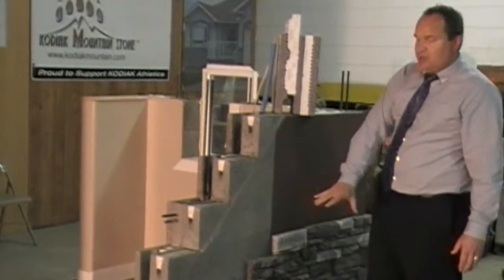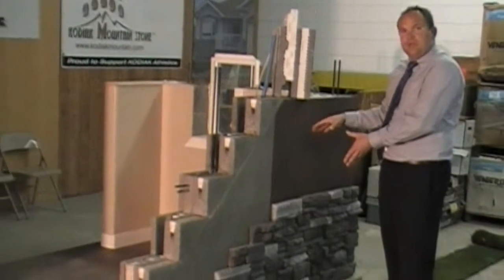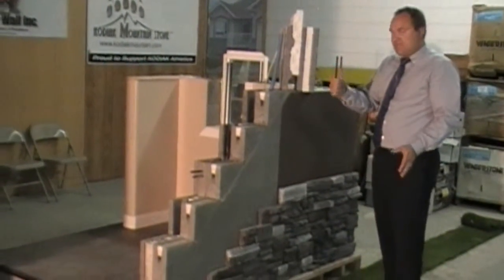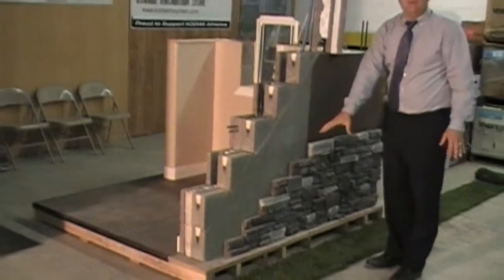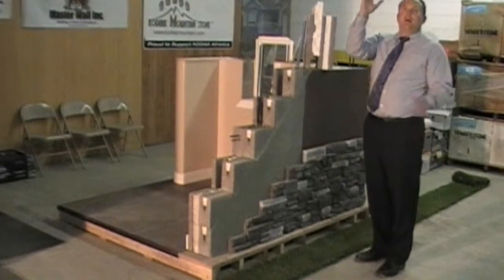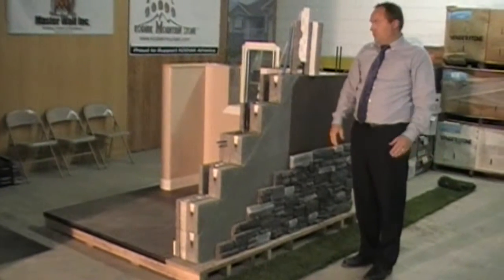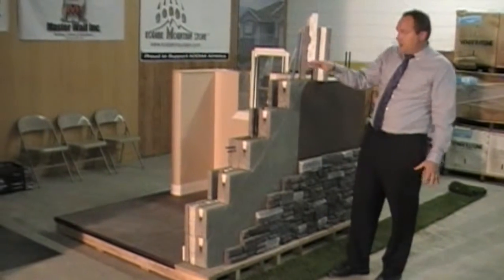When we're looking at a residential home, we have the concrete footings poured, rebar that comes up, and these blocks are stacked right on the footings. You can use it from the footings through the basement all the way up to the trusses that go across from the roof.